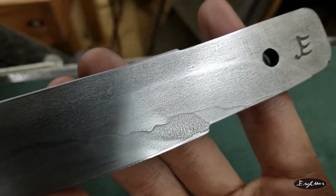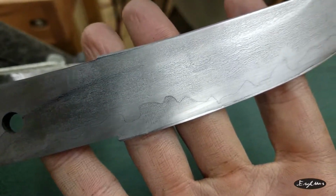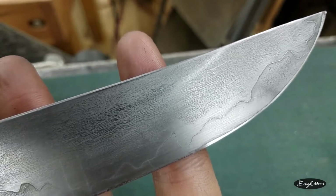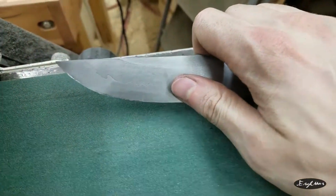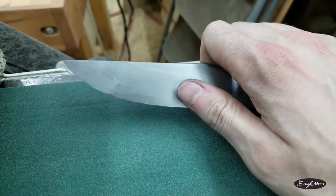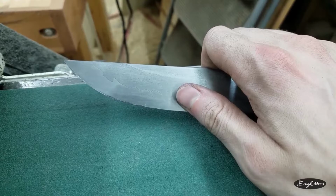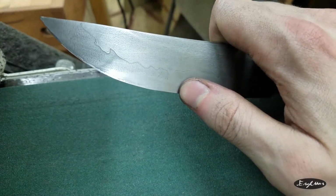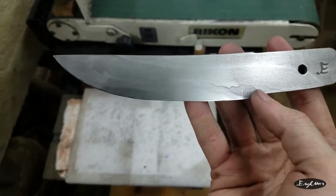Very, very pretty knife, I think, or knife blade rather. It's a super big shame that maybe I messed up the heat treatment on it. I'm still not sure. That's something that's really irritating though, is not knowing for certain, because I would probably say it's my forge welding, since I've never forge welded before. I've ground lots of things on the grinder before, and I don't think I've ever burned one up that bad, except for maybe a beginning knife. But yeah, I'm guessing maybe this one I did, or maybe it just wasn't ever hard to begin with. So who knows? That's frustrating, but I don't know.